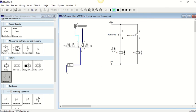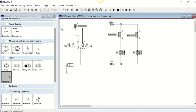So that's a very basic electropneumatic circuit, showing you how we put them together using two separate diagrams, and how they link together through the labels, and that gets us started. In the next video we're going to look at some relays, how we use them, and how we can do some latching with them as well.